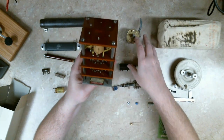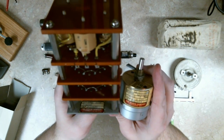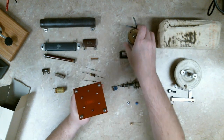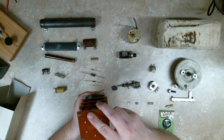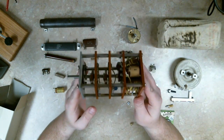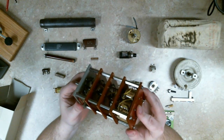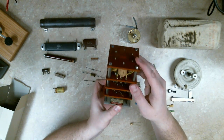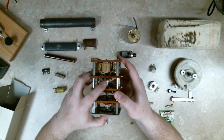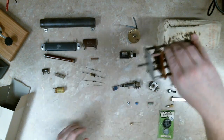You can see these are even manufactured by the same company and have similar part numbers. This one is coarser increments — 2dB steps. One thing to point out: this is so expensive that it's a resistor with a serial number. It kind of gives you an idea of the extremes on some of these devices. Connections: one, two, and three — you've got your common and the other ends, as if this was just a regular potentiometer.